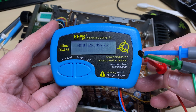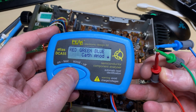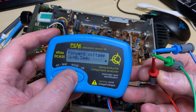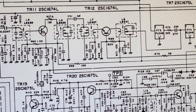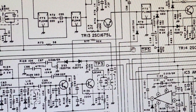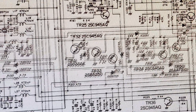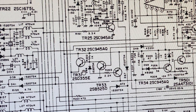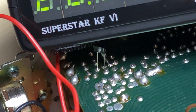We've found the transistor — and it's now a diode. Following this line down that connects all the RX stage, follow it down to TR31, and the one next to it is the transmitter which was working. So I've just tacked a transistor on the back just to try it.